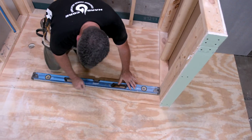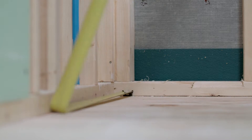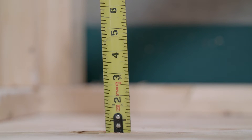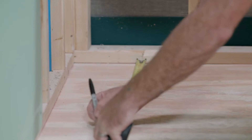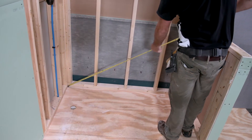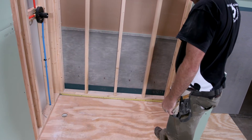The curb will be installed between the two outer lines. The inside area will be for the slope. If your drain pipe is in place, confirm that your drain pipe is approximately one-half inch below the face of the subfloor. Measure from the center of the drain line to the inside lines traced on the subfloor and from the center of the drain body to the stud walls. Check for accuracy and record these measurements. Remember to measure twice and cut once.